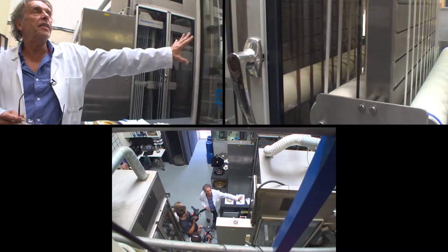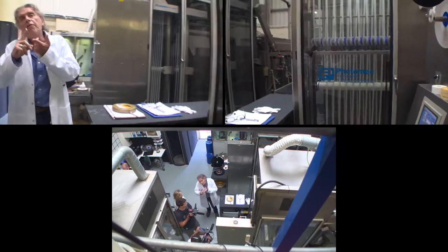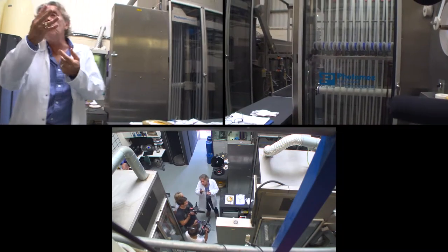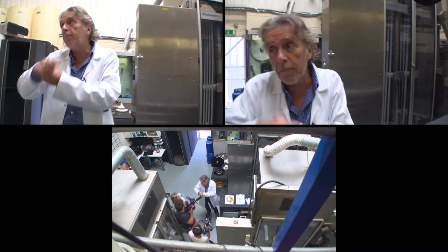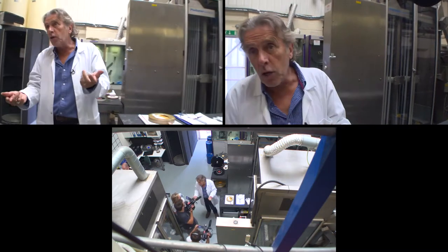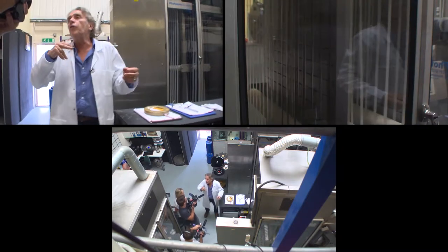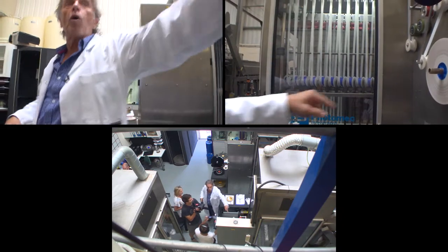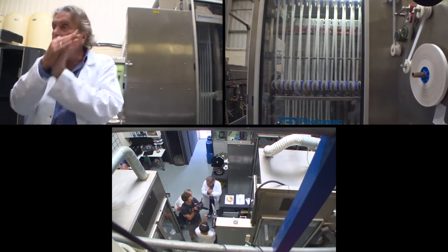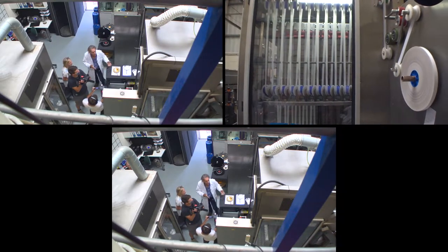The film is in this drying cabinet here. If you over-dry the film, you induce a curl in the film, which means it will not sit flat on a telecine gate or in a printing gate, thereby causing potential focus issues when you're trying to transfer, scan, or print it. If you don't dry it quite correctly and there's moisture left in the film and it takes up on a wind, it will adhere to itself and potentially damage the emulsion when you try to unwind it.